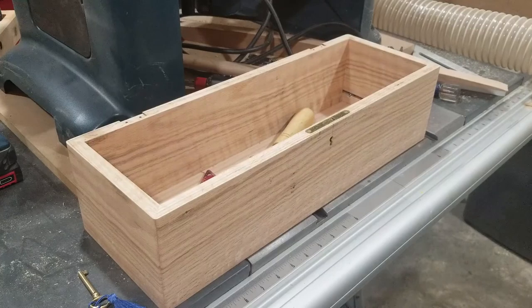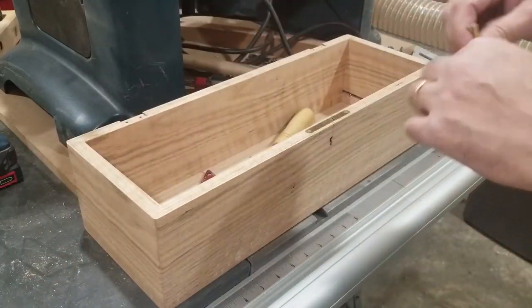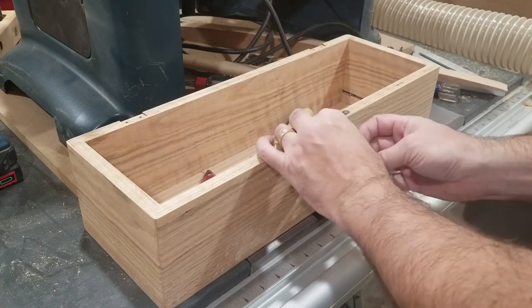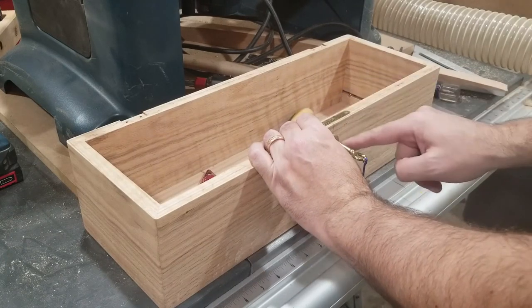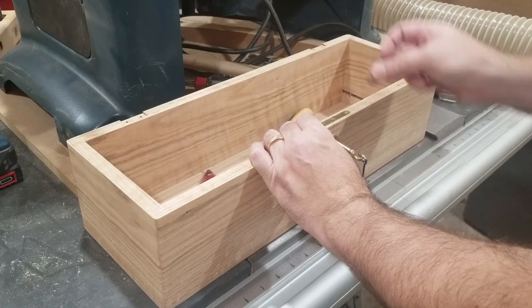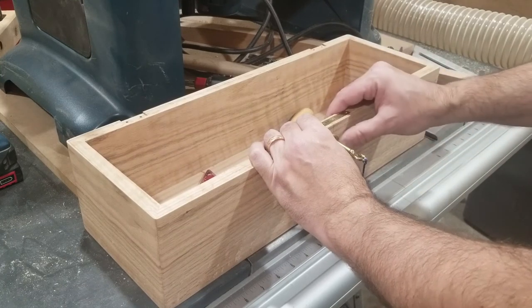I think you guys can figure out how to put the escutcheon on. I mean, you essentially line it up, and it's unfortunately nailed in. I don't like it, but it's nailed in. So make sure your key is properly located, so it looks good, it's straight. You can only mark your holes really with the nails. It's always going to fit through there. So mark your holes, tap that in very easily, and you're done. I mean, call this a day.